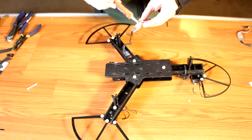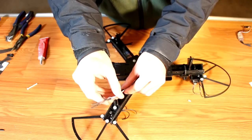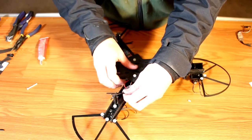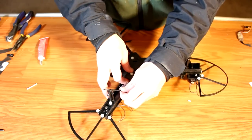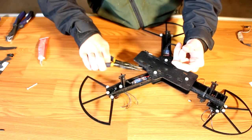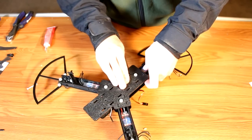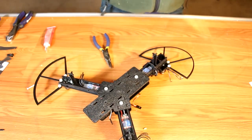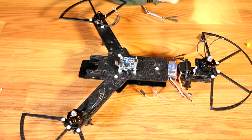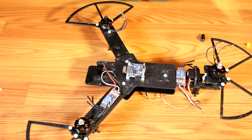The arms have enough room to install most small 12 amp speed controls inside them, so if you don't want to mount over the top, inside the arms is always a good option. When inserting the ESC into the slot, note that in front of the arm there is a small slot for the wires to come out. You'll probably have to fish these out with a pair of needle nose pliers, but there should be plenty of room to bring the wires out and around and then up into your flight controller. The rear arm can be a little bit tricky as there's more material to go through — it's going to slide back a little bit into the frame, but its installation is the same as the rest. Some speed controls just don't fit inside the arms, and for these, mounting on the top is fine. Mounting on the top also gives them a lot more cooling from the wash of the rotors. I'm just using basic welder adhesive here, but double-sided tape and zip ties will do just fine.